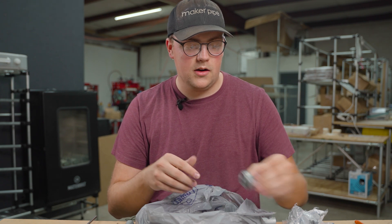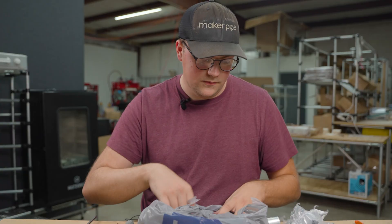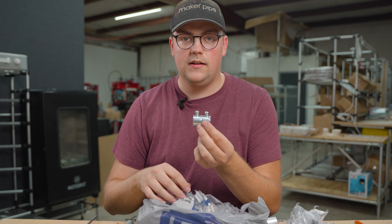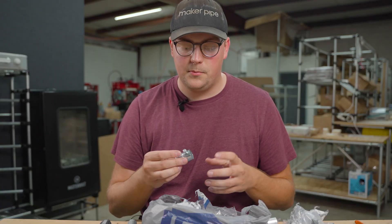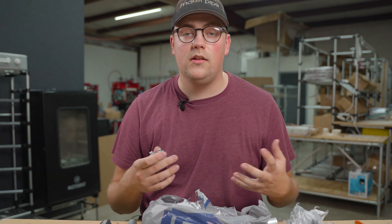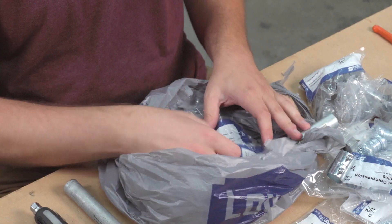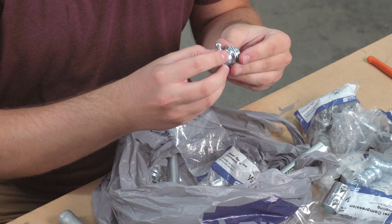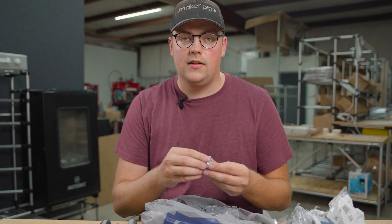The other style of coupling is the set screw coupling. It does the same thing — it connects two pieces of EMT conduit — but instead of having a compression ring on the inside, it has set screws which cinch down on the conduit. It's a little bit cheaper but doesn't have as good a seal and isn't as strong a connection as compression couplings. Just like everything here, it's all based on your application and the specific codes you have to follow when doing electrical work. We also have here another steel set screw connector for half-inch EMT conduit — same thing as the zinc one we looked at, with a nut on one side, threads to go into an electrical box, and a set screw on the other side for securing the conduit.